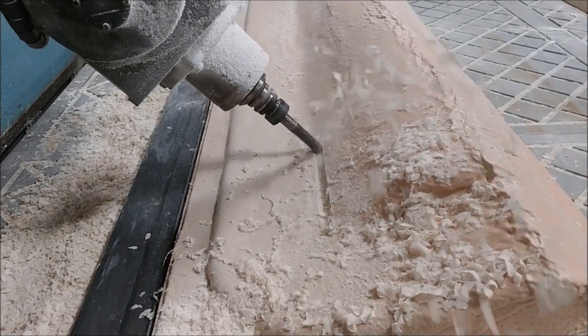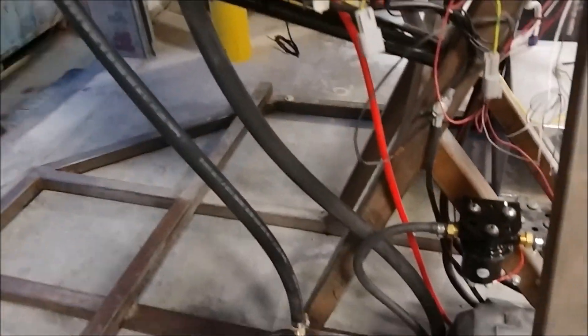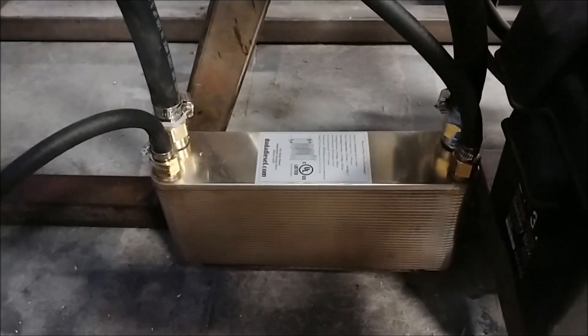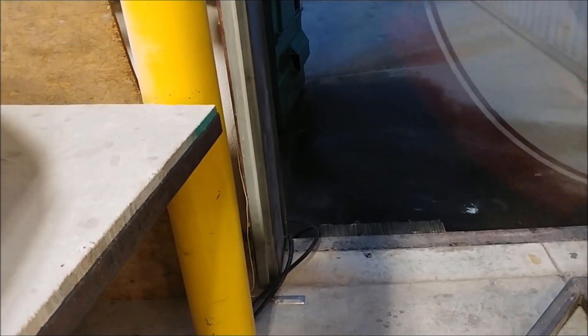I was in on the weekend on Saturday and hooked up the heat exchanger, which is going to run water sitting in a big 55-gallon drum out the back. On Monday evening I fired up the engine. There's a pump to circulate it and a filter to make sure no debris gets into the pump or the heat exchanger. I was just waiting for the engine to warm up.